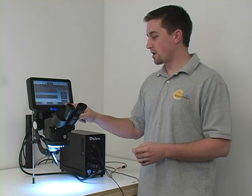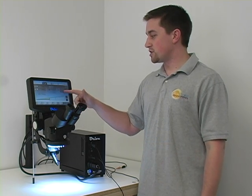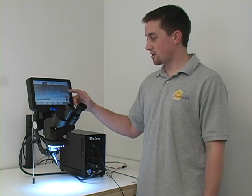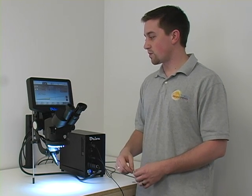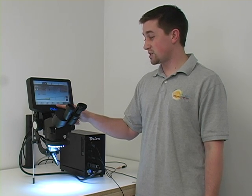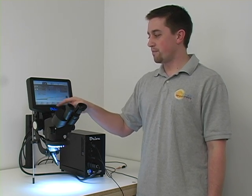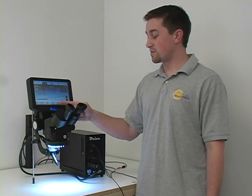Make sure you do have the play button highlighted. In arc mode, to start off keep it in single fire. Touch detect means you just automatically touch and it will weld. Use standard plus ignition and sloped agitation. The majority of your work should be here within the nano or micro range — that's where I would recommend and where I stay most of the time at a demonstration.